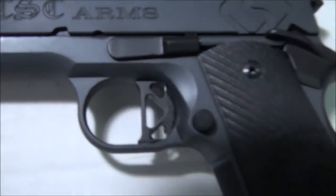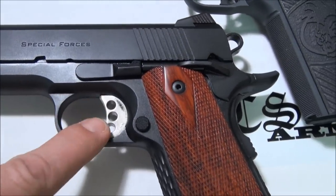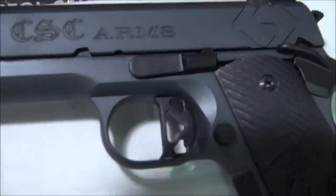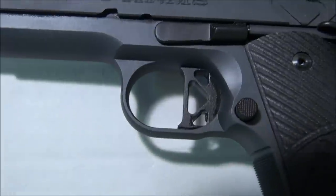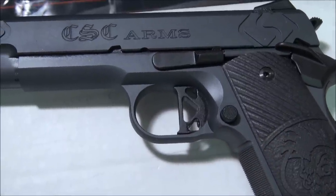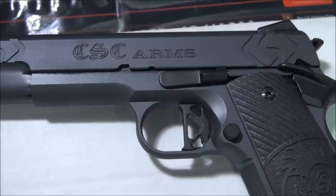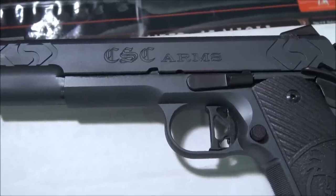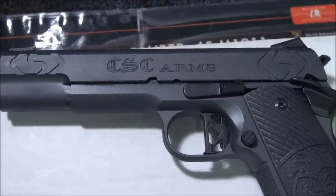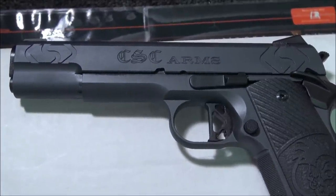The trigger is really special. There's a rounded trigger and a curved trigger compared to a flat trigger, and Bernie installs a flat trigger on all his guns. With a flat trigger you get positive engagement wherever you grab the trigger — the movement going back and forth gives the same positive pull. He achieves a true three-and-a-half pound pull through filing, stoning, and filing again on the sear and hammer — about four or five hours of trigger work alone — then verified on a gauge.